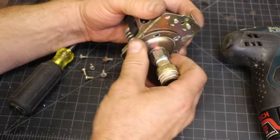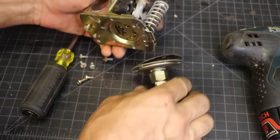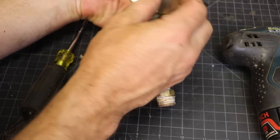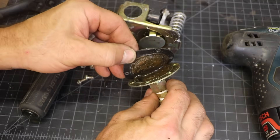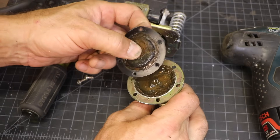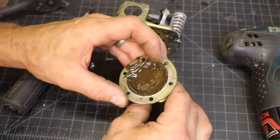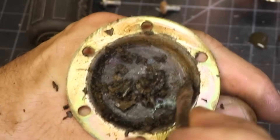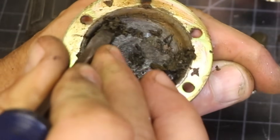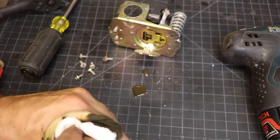What's behind door number one? It was really stuck. Okay, so there was something in there — maybe that's the problem. The diaphragm still feels flexible but it's all full of schmoo. I'm betting it's totally plugged so that the pressure switch never saw any pressure. Let me go clean that up. I'm taking a screwdriver and just scraping away at this and the central orifice is just totally plugged. Of course it was not turning the well pump off because the switch was never seeing any pressure. I have a feeling that cleaning this out is going to fix it.